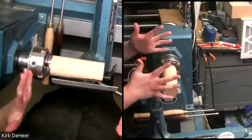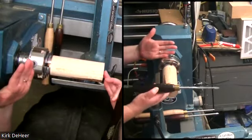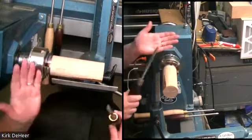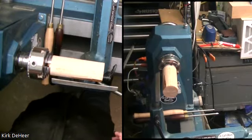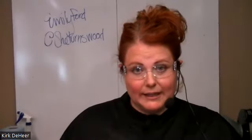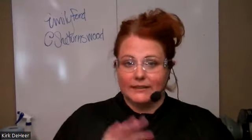Tops are super super easy. We're going to start with a spindle gouge — this is already roughed out in my chuck. It's a three-eighths spindle gouge ground to a 35-degree angle — that's my personal preference. I like it sharp especially when doing ornaments because it lets me get into little nooks and crannies. I am going to wear my safety glasses. At home I would usually wear my face shield with respirator protection as well, but since I'm demoing today this is what you get because it's easier to hear me. At home, remember: protect everything, your safety is your issue.